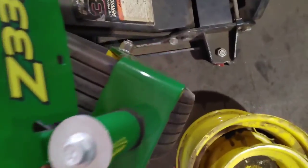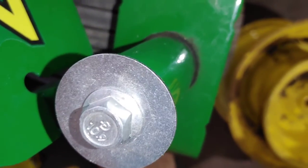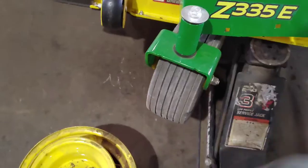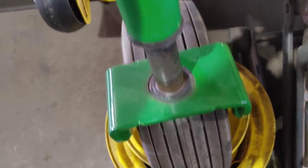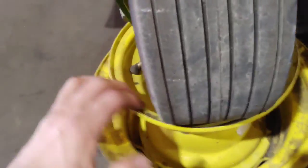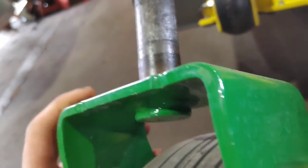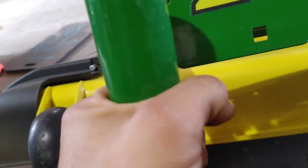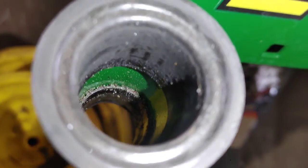I don't know how they expect them to last. Like I said, this one only had 14 hours. I'm going to pop it off and show you real quick. It takes a 15 millimeter on the top and there's just a washer on there — there's no type of seal or anything. When I saw this one, I saw just a little bit of residue — this is the most grease I've ever seen on one. I felt inside with my finger and realized they hadn't put grease in them. It's nice and dry with a little bit of sand in there. So that's not going to help anything.